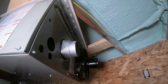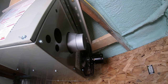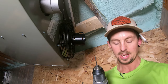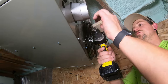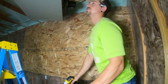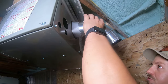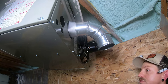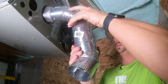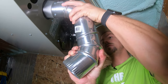We're drilling pilot holes into the exhaust outtake so we can attach our first elbow for the venting. We're using a drill bit just slightly smaller than our sheet metal screws and drilling three separate holes. We're going to run two elbows and then another piece of regular straight snap-together venting to get us up to the double wall to go outside. The crimp side goes in with the smooth side — you just work it around and push it up nice and tight.